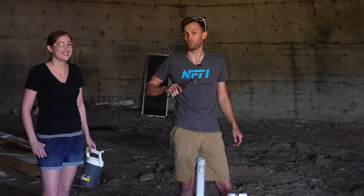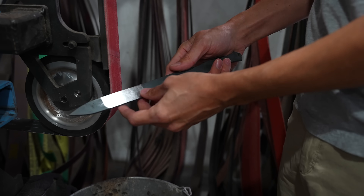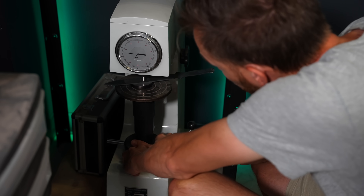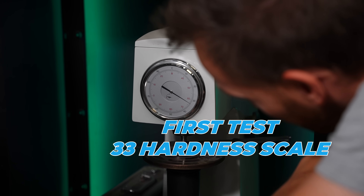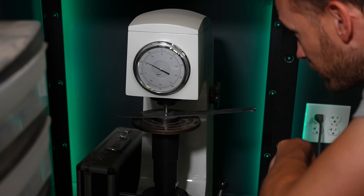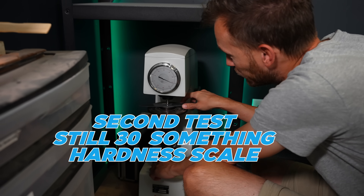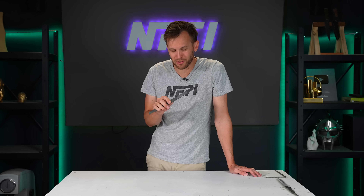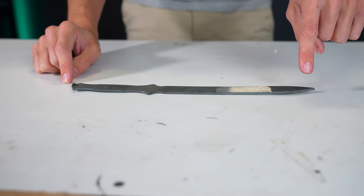I'd say we have a quench. Time to find out how well it works. I've quenched the knife and now it's time to find out what hardness we've achieved. I cut off the handle and I'm going to grind away a little bit of the surface to make sure I'm testing the metal and not the hardened scale on top. First test gives us 33 — let's do one more to double check. And again, low 30s. For those unfamiliar with the scale, we'd ideally be looking for something around 60, and this came in at 30, whereas before it was hardened it was probably around an 8. So 32–33 is pretty bad. Combined with the fact that it picked up a significant warp and liquid oxygen is frankly just hard to get your hands on — I would say it is not a good material for quenching a knife.